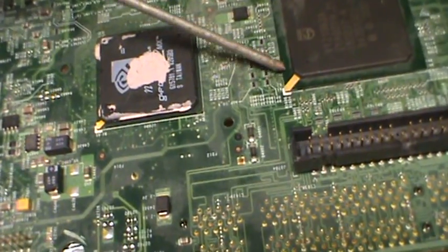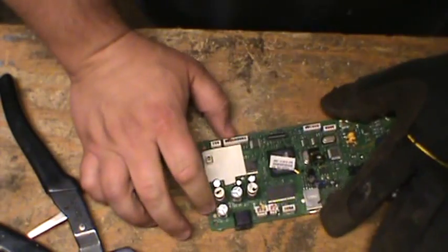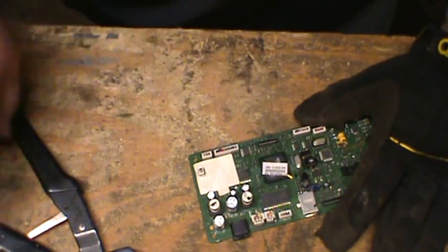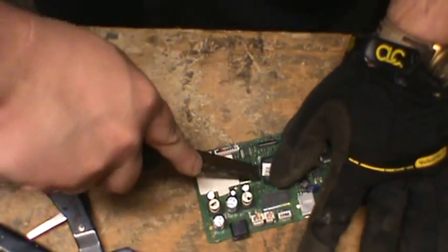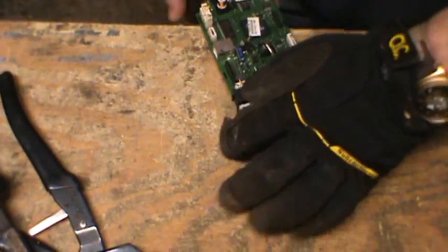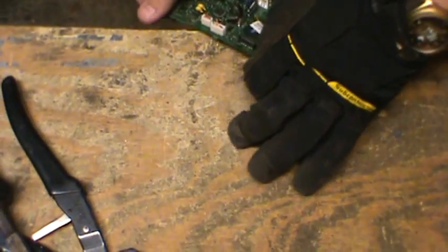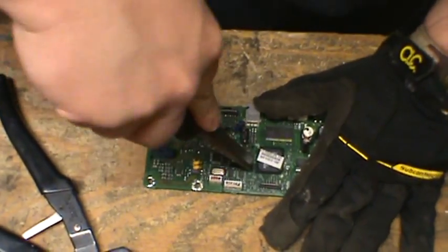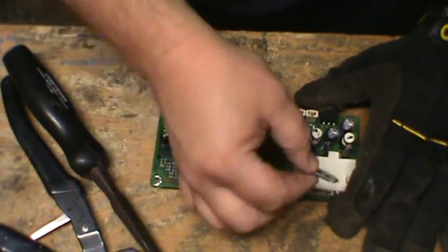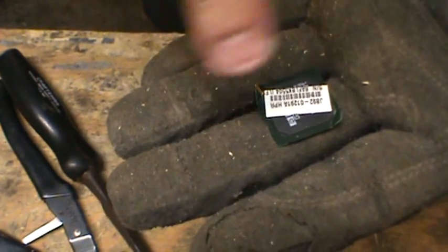The larger IC chips — if you see that little strip of gold right there, those are worth some money as well. Like this one, you still have this flat pack chip over here. What I'll do is I'll get my chisel and just get under it. Sometimes it helps to try and bend the board — that way you break some of the connections underneath it, which makes it easier to pull it off. There you go. There's that flat pack chip with that little strip of gold right there on the corner. And if you take this black plastic piece off the top, you're going to see a bunch of swirls of gold foil in there.